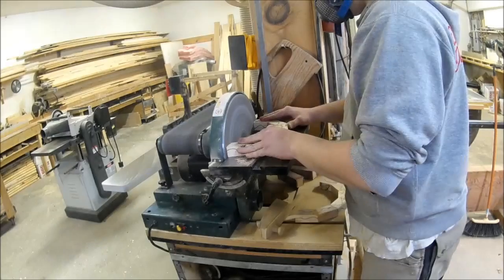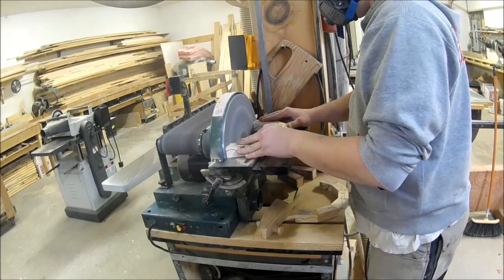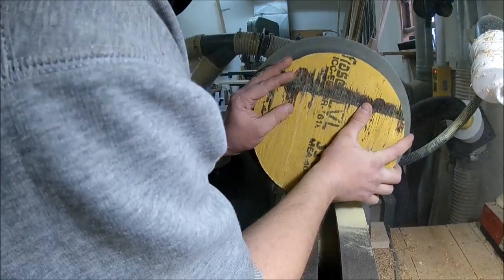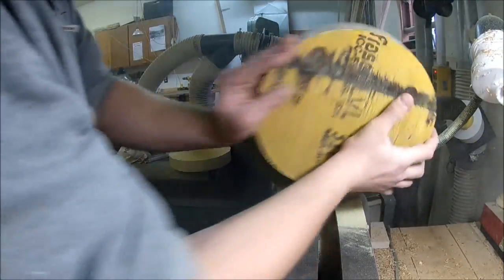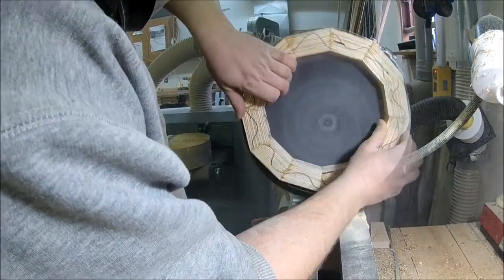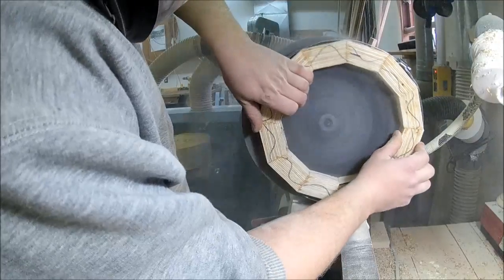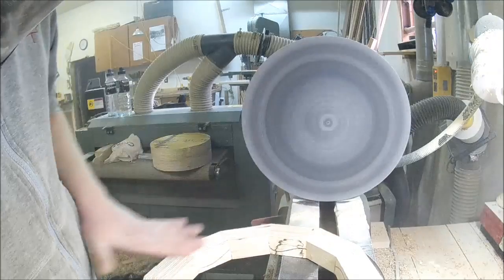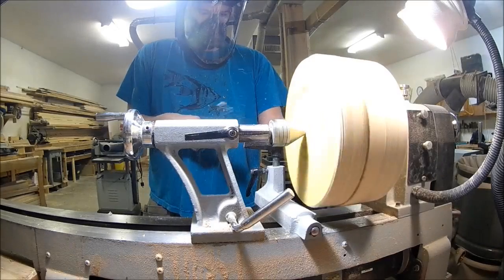The ring is now dry enough for me to sand the faces flat and glue the full ring together. I prepare all the pieces to be glued together by sanding the mating faces flat. I could run these through the drum sander, but the yellow coating clogs sandpaper, and it's easier to replace a 12-inch disc than the sanding paper on the drums. I let the glue cure overnight.